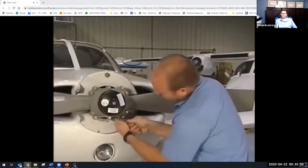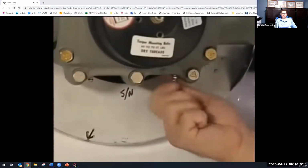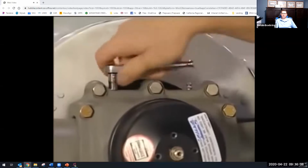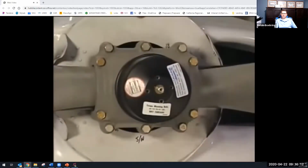If the propeller is brand new, you should grease it after 1 or 2 hours. This is because the centrifugal force will pack and redistribute the initial grease. Aeroshell 6 is the recommended grease in most Hartzell propellers. On aluminum hubs, each blade socket has 2 grease fittings. Remove the Zerk fittings from the side of the hub that corresponds to the blade trailing edge. Take a piece of safety wire and make sure the opening is clear.